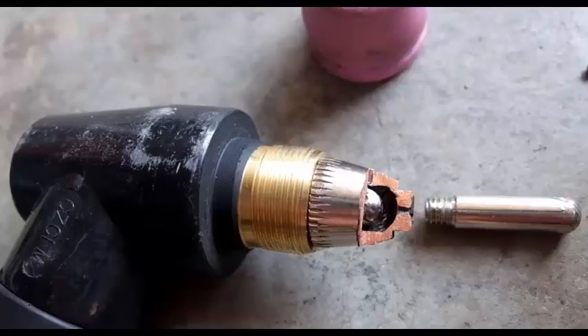Here's a picture I found on the internet. Notice there's an extra anode to the right-hand side and also an anode installed inside the cup, with the cup screwed over with a cutout. Notice the gap between the end of the anode and the hole in the cup — that gap is way too big and this person is having problems; it wouldn't arc because of that gap. The pink thing above is simply a heat shield that guides the air over the cup to cool it.